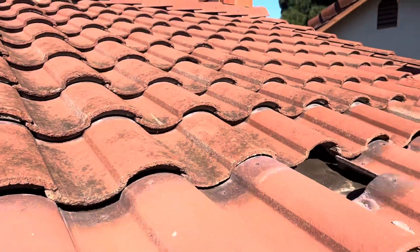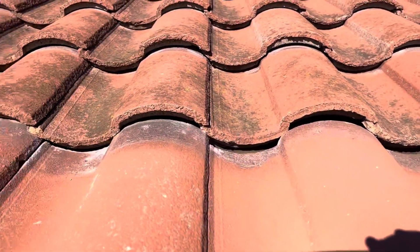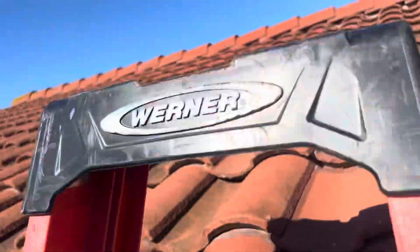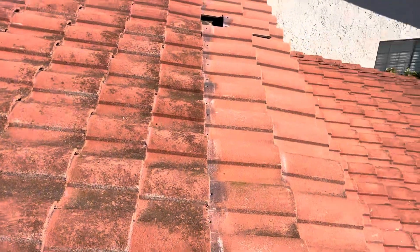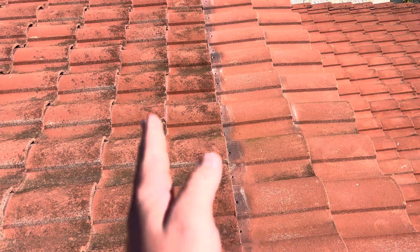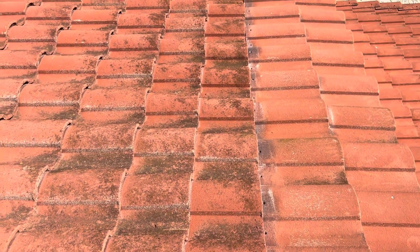...is they basically replaced some paper on this section. But when we get up here, we can see that a bunch of tiles have slipped down and we can see a bunch of nail holes that are exposed. Right here, we can see all those tiles — the nails have been exposed and they're sliding down. It's not waterproof anymore; water can actually get in.